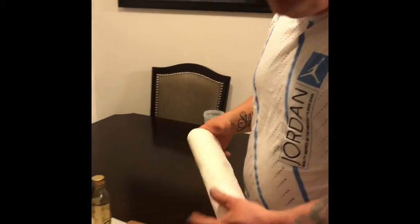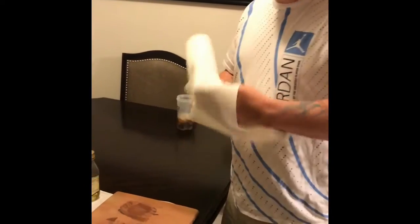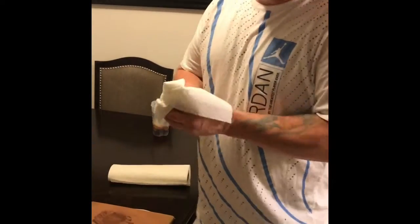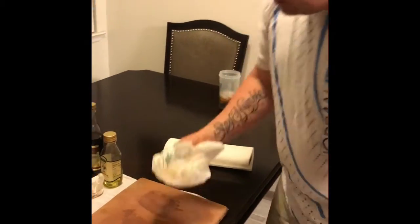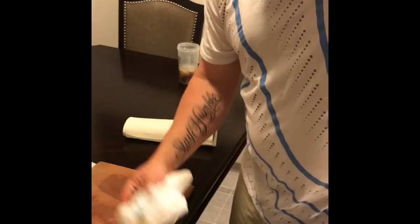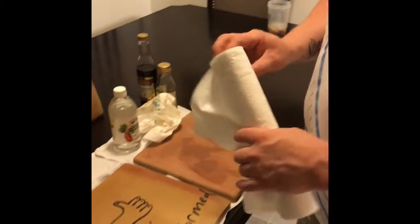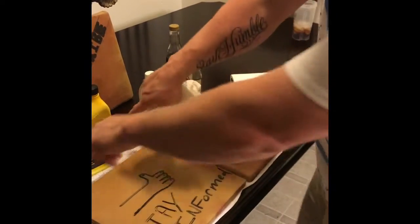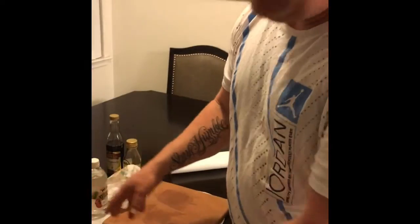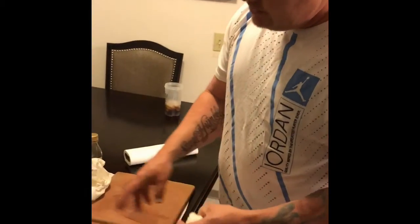This is just a particular Saltillo, but marble will do this, slate will do this, flagstone will do this. Any tiles. I've seen porcelain do it, because even though it's not a true porcelain tile, it does have a little porosity to it. So you can see, obviously, the oil just completely ruins it. You can see this one, with a good sealed tile, comes back and does what it's supposed to do. You can clean it right off. The grout will do the same. If there was grout around here and this was your house and you had the sealer and the grout, it would clean off the dirt, the oil, same thing. So just because I don't have grout here, it still will do the same thing.